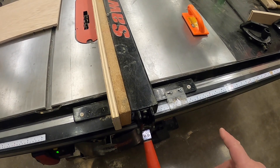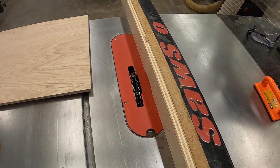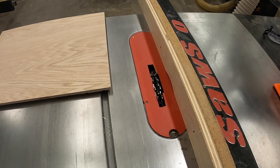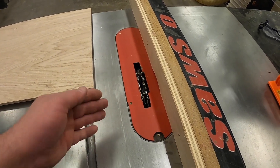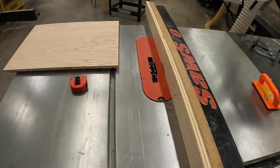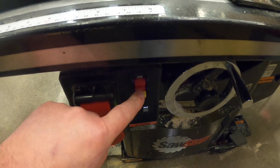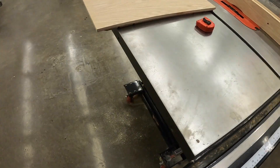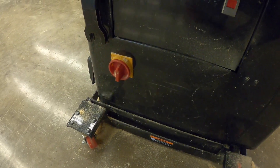Because our fence is not accurate with that cursor, we're going to set the fence with our tape measure by taking the tape measure against the fence up to the blade. Before we do that, since this is metal and we don't want to set off the SawStop, and our hand would be closer than four inches away, we want to shut the main power off to the motor. Down at the control panel there is a little yellow switch that will turn the power off — you can see the power is off when the lights on the machine go out. Over on the side of the machine on the floor is a lockout/tagout main power switch; just quarter-turn that to turn the power off.